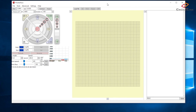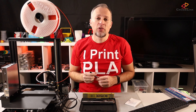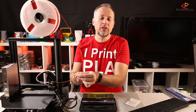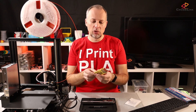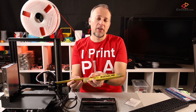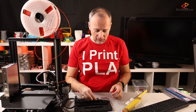To connect to my printer I'm using Pronterface — that is a freeware software you can use to connect to your printer and send over commands. Alternatively, you can use Octoprint; in Octoprint you have a terminal tab that you can also use to send commands to your printer. The next step is to take a permanent marker and find a point on the filament that is exactly 120mm away from the extruder inlet. I'm marking that point — you can use a ruler placed against the inlet and mark the point at 120mm. You can also use a digital caliper which might be more accurate, so find what works for you.